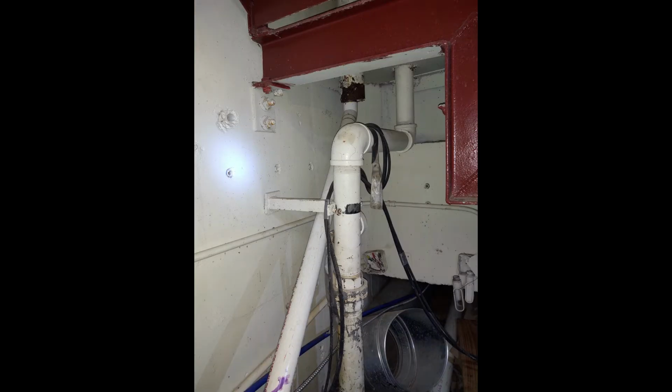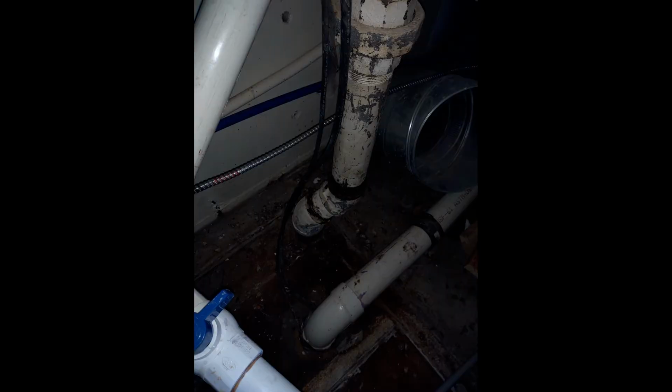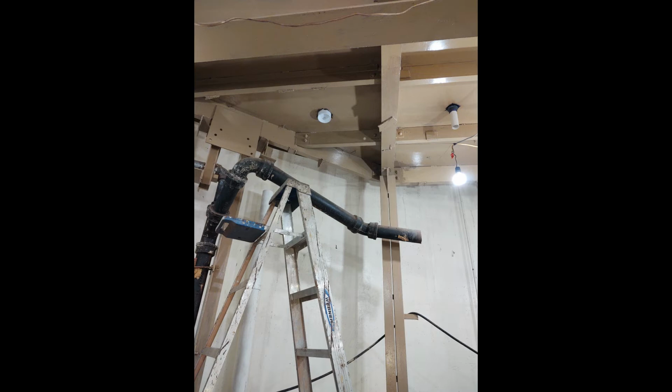We've sleeved it inside of a 4-inch steel line. That's a picture of underneath the stairwell floor. And then that's the sump itself as you see it's going down. There's a brass check valve for that line. It's got about 45 to nearly 50 feet of head pressure. That's the intake line coming from the bathrooms.